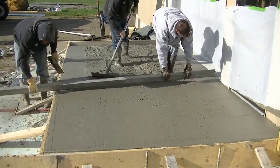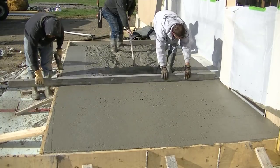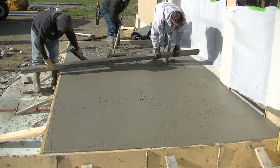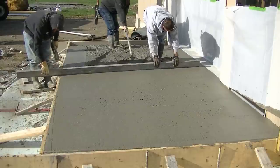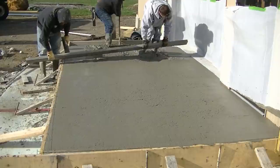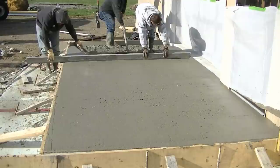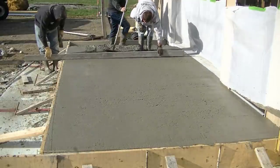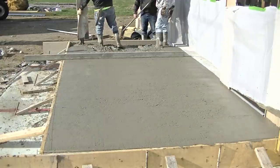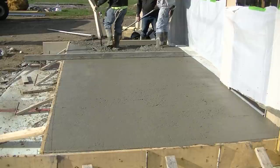The screed actually leaves a tiny little line in the concrete if you score right — you'll be able to tell, you can kind of see it as I'm going. That's what I'm looking for. As soon as I see that I've scored, I just keep moving. That's how you screed off the top of a form — it's actually pretty easy, one of the easiest forms of screeding concrete. We also got a string going around the outside edge to make sure the forms stayed nice and straight, and we used a laser to set everything right to grade.